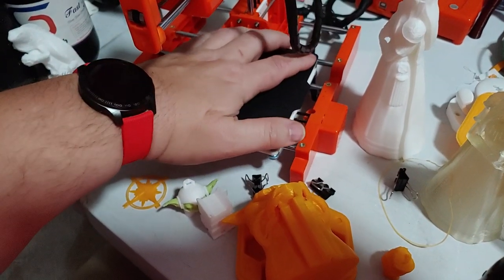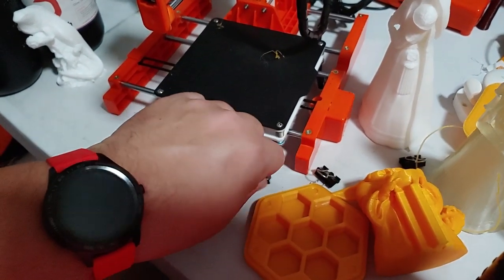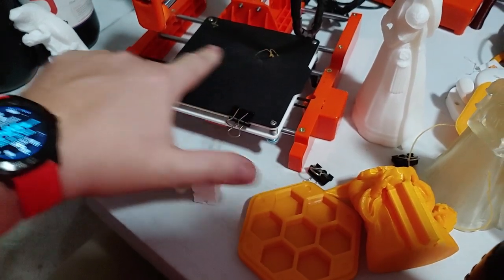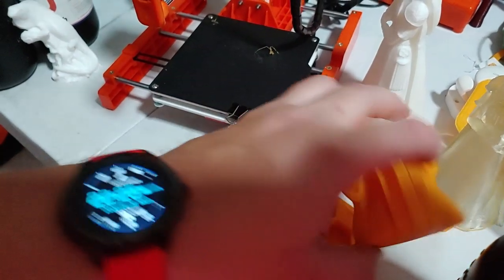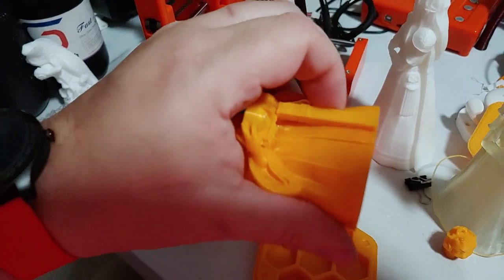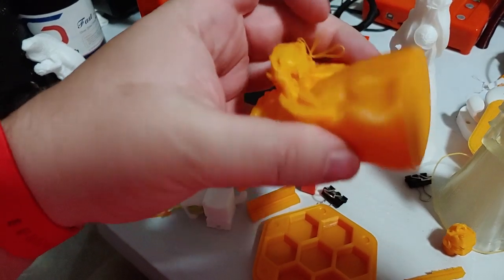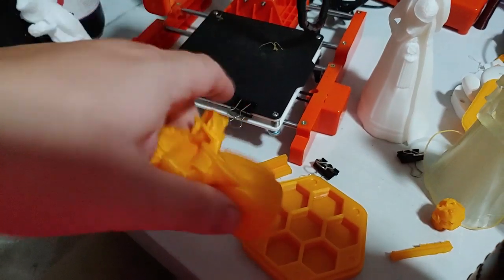For anybody who has this printer, a temporary fix is actually pretty easy. Get that bed on there nice and just put three clips on it. I would suggest two clips up here and one clip back here — that will hold it in place just fine. It's still going to warp, you're still going to have a slightly non-flat surface, but as you can see, that's not a big deal. Overall, nice print. Support comes away nice and clean — very nice, actually. I'm surprised that came off that clean. This gap here is because the bed broke free and was sliding around.